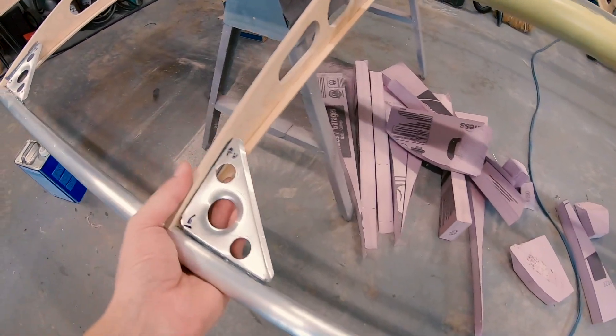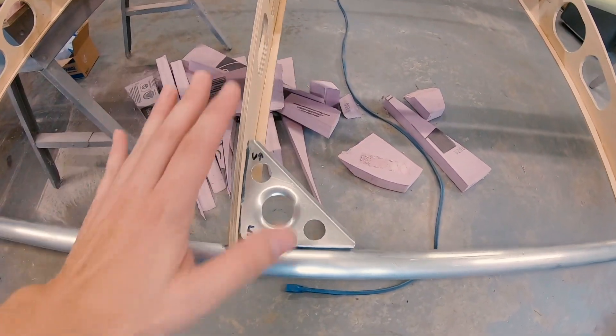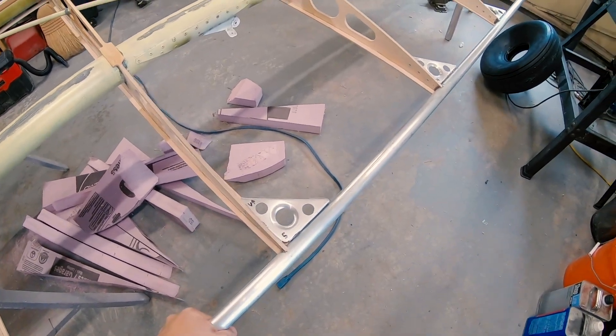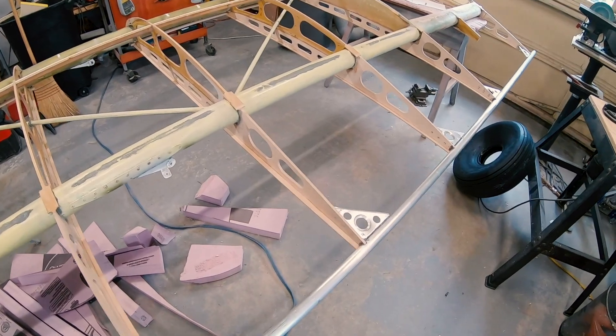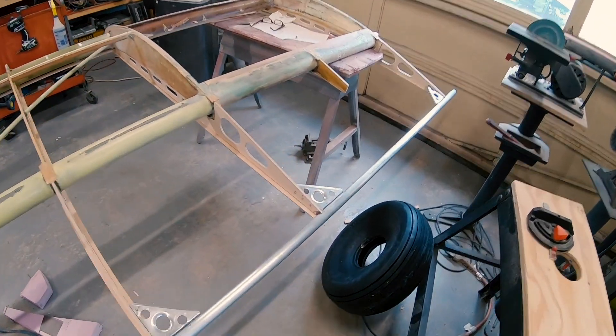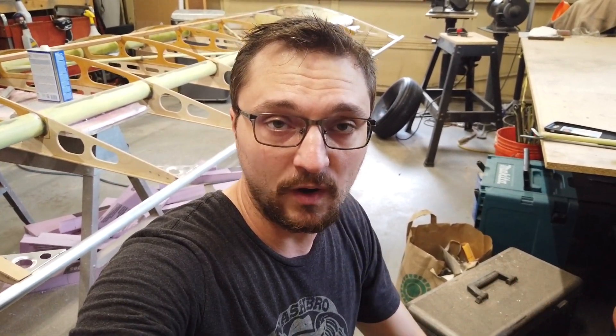So after all of that, this is what we're looking at. We've got our nice little 45-degree pieces riveted and glued in place. We're going to add some more glue on this side since we flipped the wing, but they look great — the trailing edge is on there and it's incredibly solid. There are a few other things you can see in the background, but those are for another video. We've got the cap strips in place — you'll see all of that coming soon. Right now, I'm just really happy with how this turned out. This video has been a long time in the making, and we did get a lot of work done. We've got more coming soon — some rams footage, other content in the works. So until next time, like, subscribe — we'll see you on the next one.